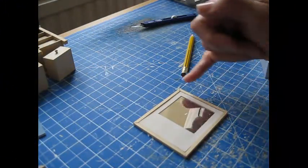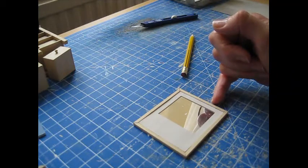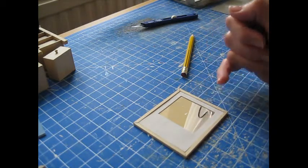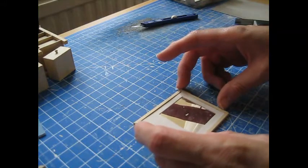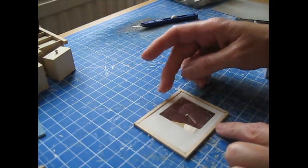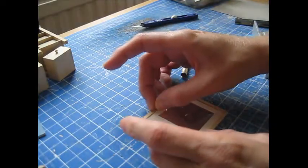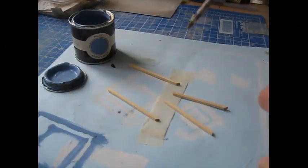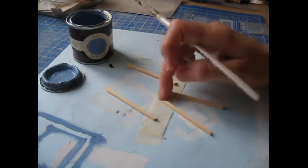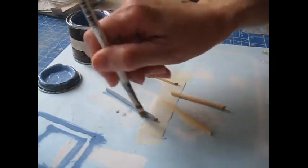Once you're happy with the fit around the outside, these can be painted. If you're having trouble getting an exact fit, you can use a little filler once the frame is fixed in place to fill any corner gaps — mitre joins are quite difficult, so just keep laying pieces in place and trim a little more if needed. Once you're happy, paint the pieces. As with the surround, attach them to tape on the painting sheet and make sure you get paint around the sides too, as they'll be visible once attached.